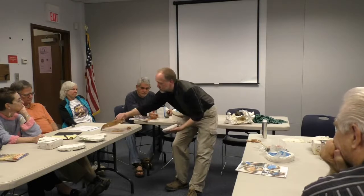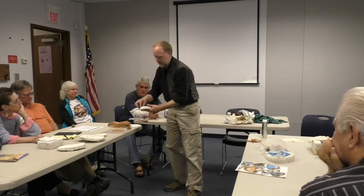You can kind of see it there, and when I turn it the right way, it fits right up in here. Okay, so then I needed to make a mother mold around it because this is flopping all over the place. And then I learned some things about making a mother mold. I got really fancy. I covered it with plaster and put burlap reinforcement in it to make the plaster mother mold strong around it. And then I put wood in there to reinforce it.